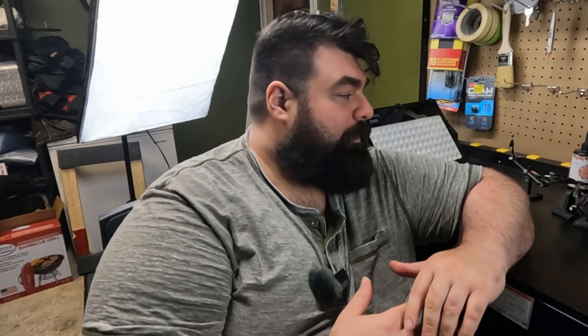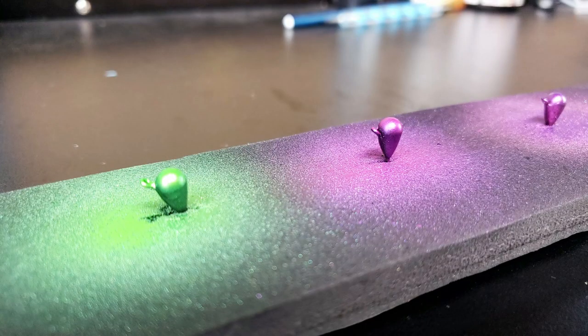I highly suggest you properly prep all your jigs before you actually do anything with them. And this includes washing them, because there's gonna be some kind of release agent. Even oils will screw it up. That's the big one that's gonna hit you, cause your paint not to stick. You're just gonna have a bad time. And that's life, you know. But isopropyl alcohol, that's gonna be one of the best ways to clean your jigs off and make sure that they're ready to take that paint.